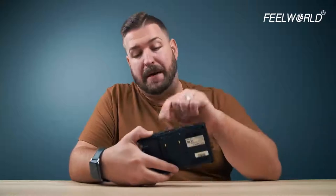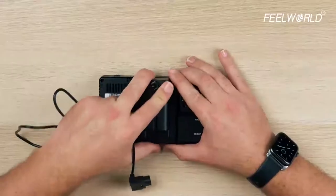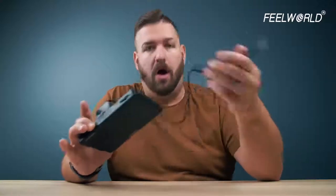If you are running universal power, you can power the monitor via the DC port, or get a dummy battery — an NPF style battery — which you mount here and then use a D-tap adapter, which is a much more familiar port type on a camera rocking an Anton Bauer, V-mount, or gold mount battery. That's another option there.